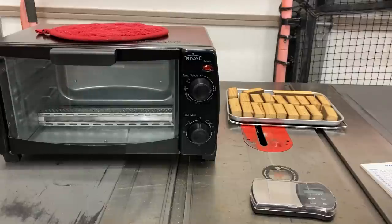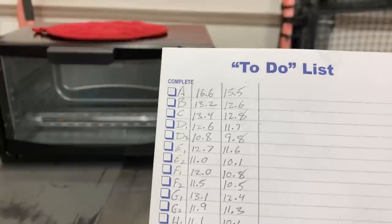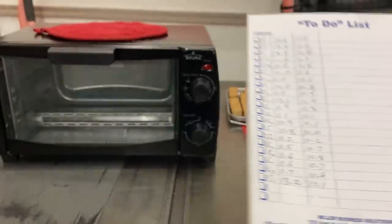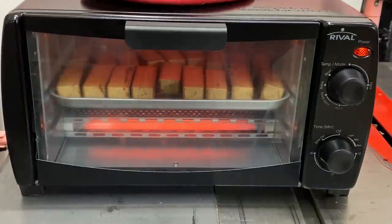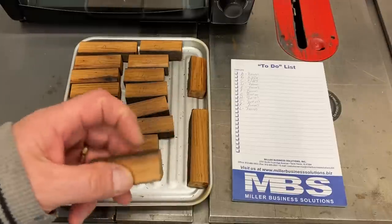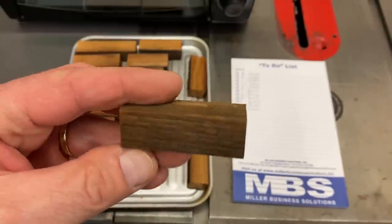The blanks just finished their first 30 minutes in the oven. You can see from the list that each blank lost a little bit of weight. We're going to stick them back in for another 30 minutes. I finally reached the point where my blanks aren't losing weight anymore — they may bounce up or down maybe a tenth of a gram but they're staying pretty well at the same weight. I've bumped the temperature up to about 220 degrees and I'm going to give them one more 30-minute cycle. I've finally cooked these blanks enough where I'm comfortable that they are sufficiently dry enough to be drilled, tubed, and turned.